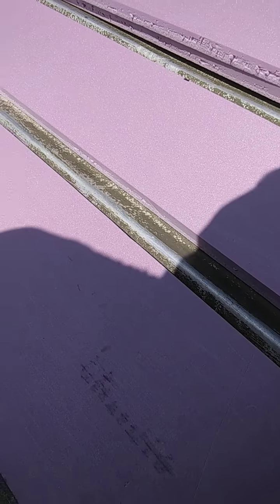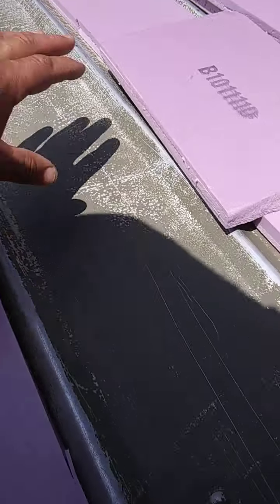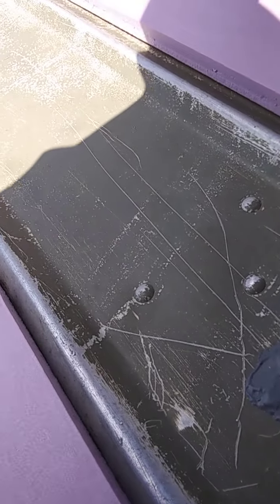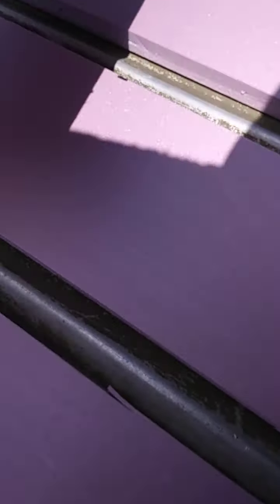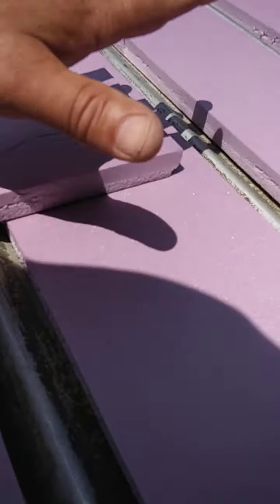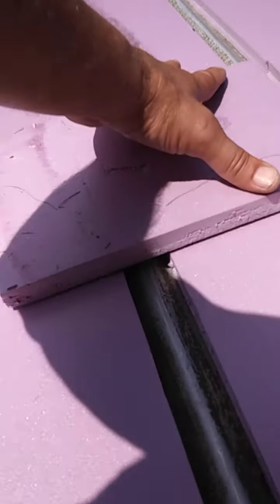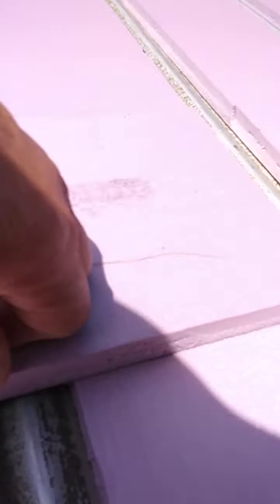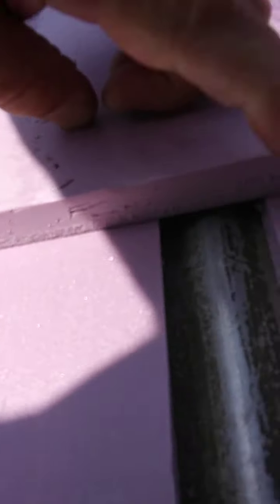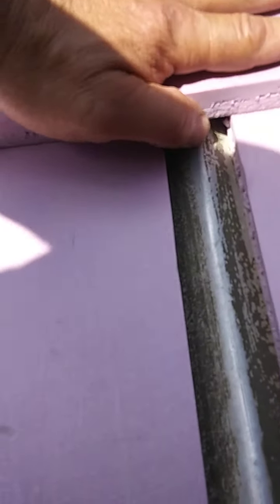Each piece, you have to measure everything — they're different sizes. This one will go in here and get glued down. Now look at the difference in the gap. See what kind of a gap I got now? Instead of from here to here for that plastic to flex, I only have an inch and a quarter gap — it's not going to flex. And if it does flex a little, it'll push down against the straight. But if I just bolt it straight on, you've got this big wide gap — it wouldn't be very good.